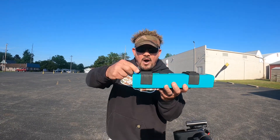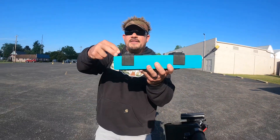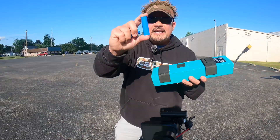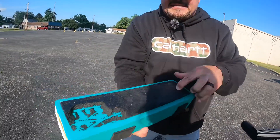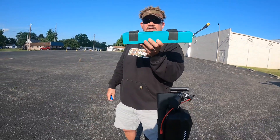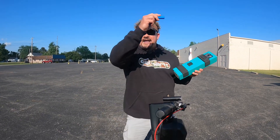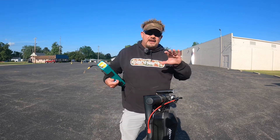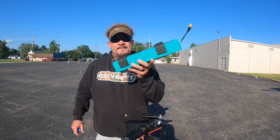Looking at this pack, I can count one, two, three, four, five, six, seven — so these cells are probably linked in groups of seven. So you have groups of seven, seven, seven, and seven, all running together at 48 volts with a certain amp-hour rating. If one cell goes bad, it can take out a whole section, drop your amp hours, drop your voltage, and trigger the safety mechanism so the scooter won't run.